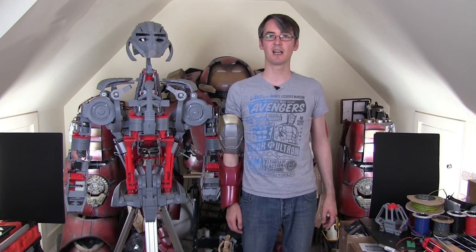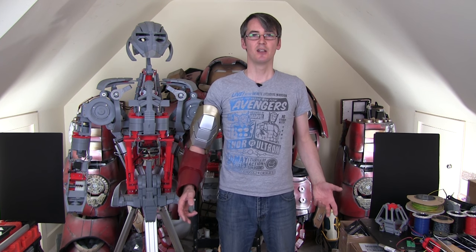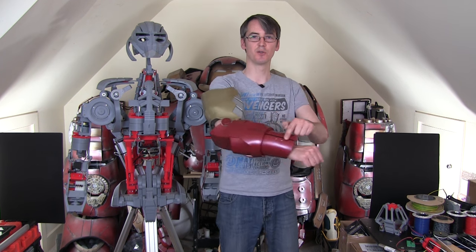Some people have suggested perhaps I should use hydraulics or pneumatics, but I don't really want to do that due to the fact I'd have to carry around the pump or compressor and a reservoir of air or oil. Also we need to control that somehow, and it's much easier to control electric motors with off the shelf parts rather than having to buy big valves to deal with all that hydraulic pressure. Obviously anyone can buy big electric actuators and bolt those onto a hinge and say that's an exosuit, but that's quite costly. That's why some of the materials are going to be 3D printed and the rest is off the shelf parts, using electric motors.